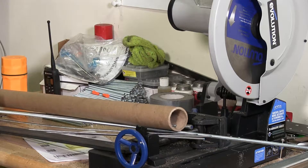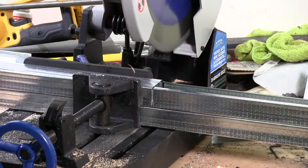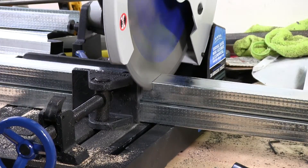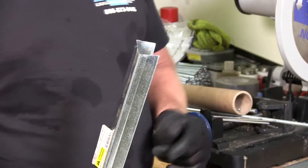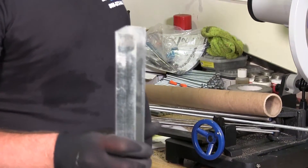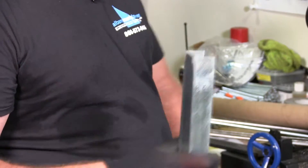I also used this saw to cut some metal track and studs. Even though it did a pretty good job, it seemed to want to catch the edges. This is thin metal, 22 gauge. It tends to grab the material. Maybe it's the blade I need to change, but I'll let you know as I go along. What I've established is: track, you can cut it; metal studs, you can cut it. If you have thicker, heavier gauge stud, you should have absolutely no problems. The thinner gauges are a problem.